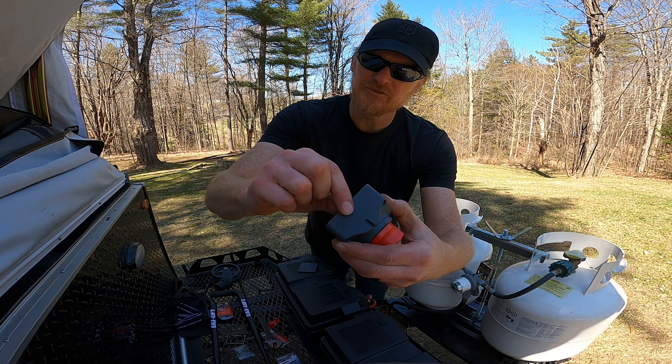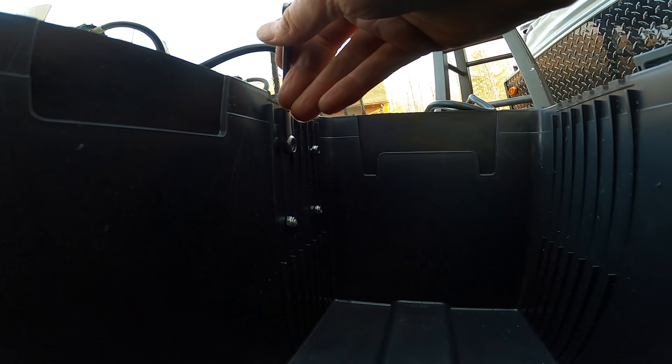I can thread it back on just fine. All the screws have been shortened — they're soft as butter so I had to be really careful. It's going to mount right on the front; I've got one screw in and I'll put the rest in. I think it's going to look great and work great — and looks matter too sometimes. That's not going anywhere; no need to over-tighten, just snug it up. We have an on/off switch — 100% power off so the batteries don't drain from any bleeding, short, or connection. It's always wise to be able to kill your batteries quickly and easily with a simple switch.